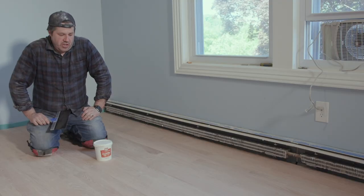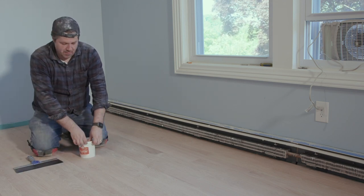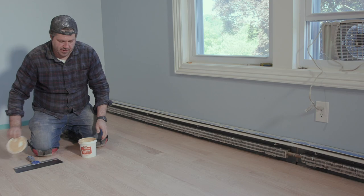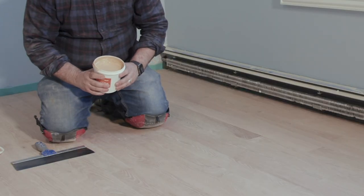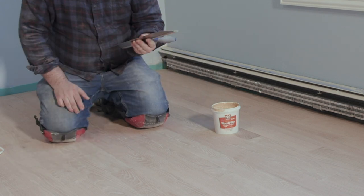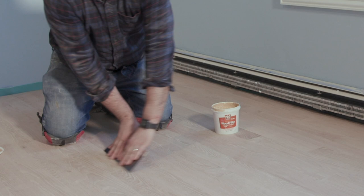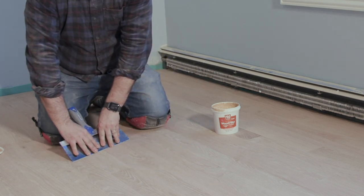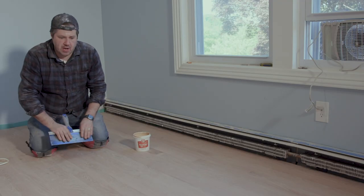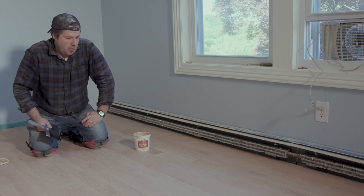So this is how the trowel fill will work. We'll open the can of wood filler. It's pre-mixed, and I'm gonna spill this on the floor. Then, using a taping knife, the same you'd use for drywall, I'm gonna very quickly work it into the floor using circular figure eight-ish type patterns. And that's to get it going in from all different directions so it fills every pore.